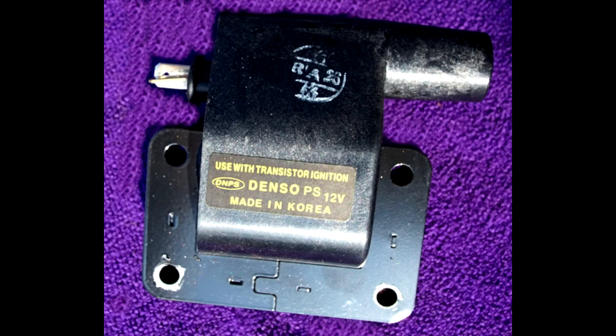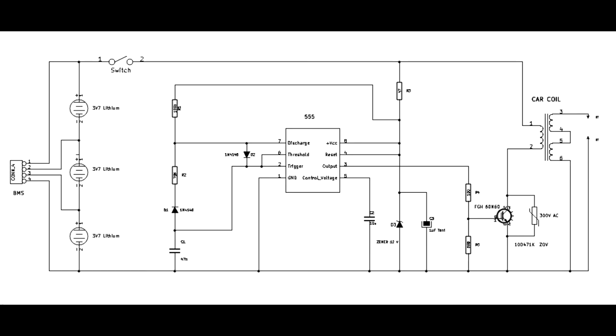I don't know how she works that out. They're easy to use. The driver uses a 555 timer and an IGBT that is commonly used in inverter welders. You should have some sort of protection on the IGBT, like a metal oxide varistor or a transorb, as without anything across it, after a few minutes or less, it will destroy the IGBT. You need some surge suppression, spike suppression — it's clearly getting more than 600 volts.